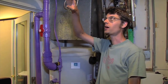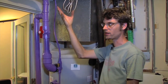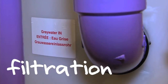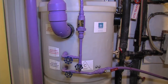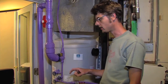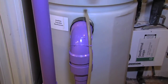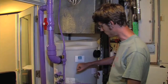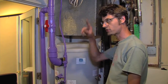We have shower water coming in from the drain — that's one story up above us. Very easy to retrofit because we could get underneath the floor and cut into that drain pipe, so it comes down through here. It's filtered through a little strainer, just something to get out the hair and the worst of the soap scum. It fills up with the gray water. There's a tablet you drop down in there, basically just bleach — same thing you'd put in a Clorox tablet for your toilet bowl — so that's slowly dissolving, keeping everything sanitary so it doesn't ferment or get too smelly. And then there's a pump inside that's automatically going to turn on and off when you flush the toilet up above.